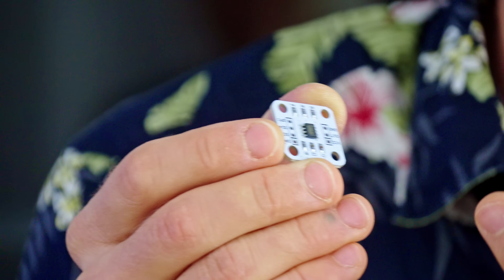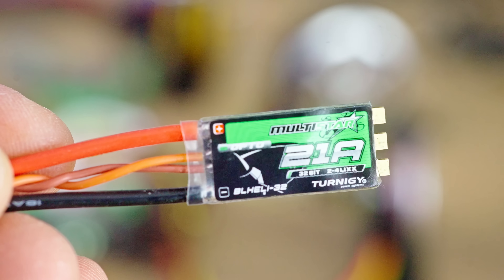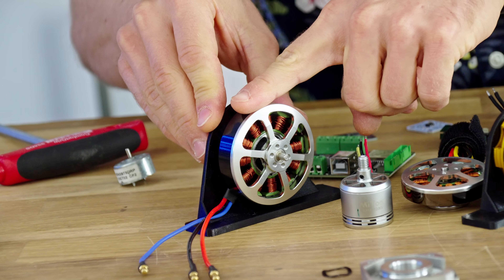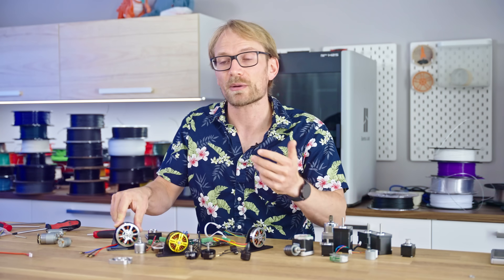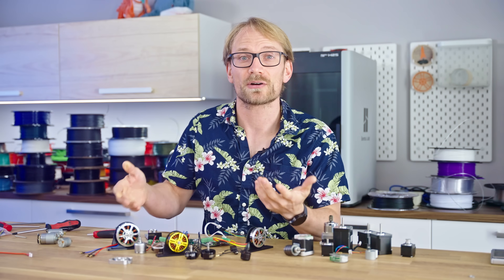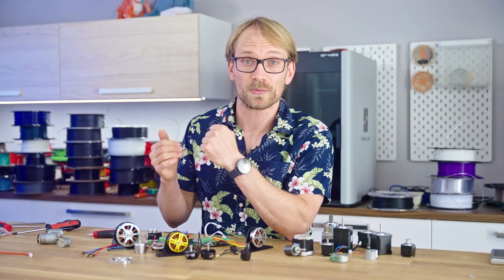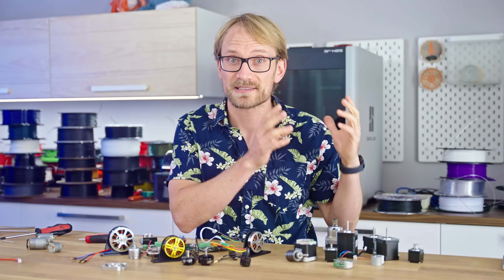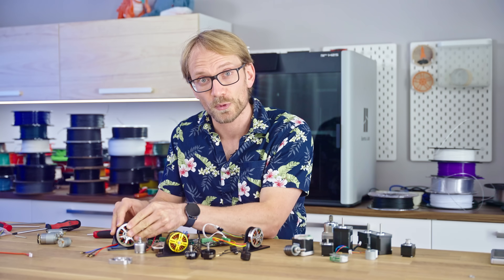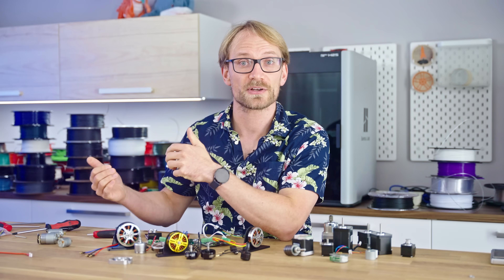This kind of magnetic encoder is also what enables the FOC drive mode. Typical BLDC speed controllers like for RC cars or drones already make sort of an educated guess for where the rotor is at any time, by measuring how much the motor is acting as a generator. This really only works at higher RPM, and for robotics and 3D printers, that low-speed control is pretty important. Low-speed control also happens to be something that stepper motors are pretty good at. But by knowing the exact position of the rotor, the motor driver can precisely control each of the coils to run the motor as smoothly and efficiently as possible.